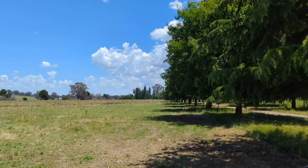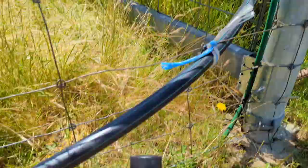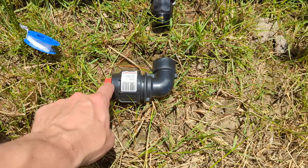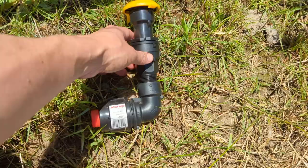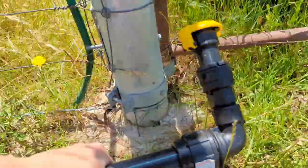So I'm back at the start — I'm going to cap the end of this pipe because we just tied it up and left it open earlier. We've got inch-and-a-quarter — same as our pipe — and instead of just putting an end cap on it, why not put a turf valve on it and have an extra watering point? You'll never have too many watering points. Your turf valve here has a one-inch thread, so you get an inch-and-a-quarter 90-degree fitting to a one-inch female. Female because it's the internal thread. Then your male one inch goes in there and that blocks the water — but if you ever want to tap your key into the top, like if you're grazing the driveway area, you've got water right at the property's corner post and you just run a little hose around.